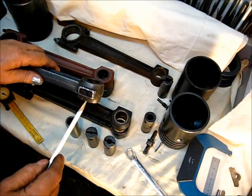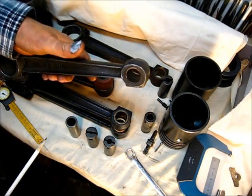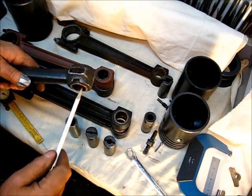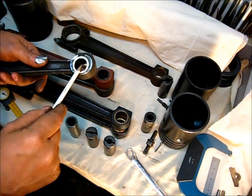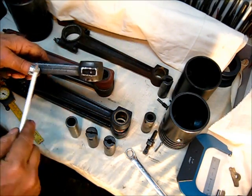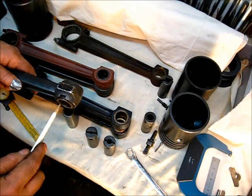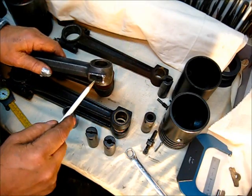If you know that the oil flows down — if you put it in this way it would fit and go good — but you would never be able to get any oil to your wrist pin bushing, and that's what happened here. This wrist pin bushing in this engine never received any oil because the bushing turned a little bit and the hole ended up off-position. I did check it and it doesn't have a lot of wear — still salvageable, only about a thousandth or so play in there.